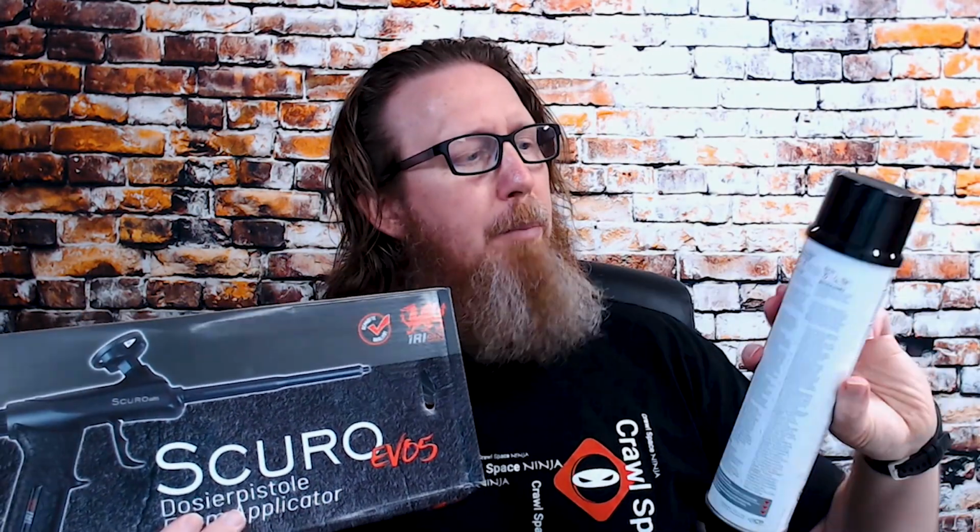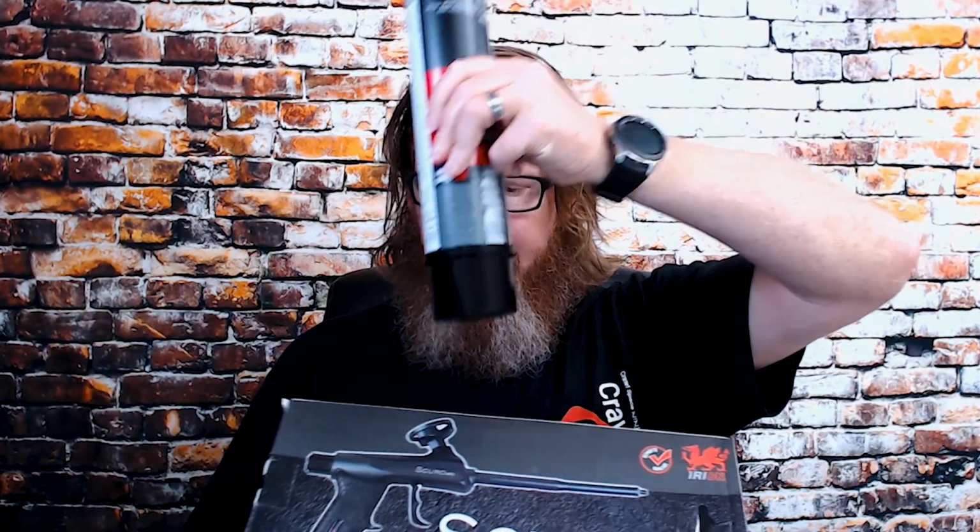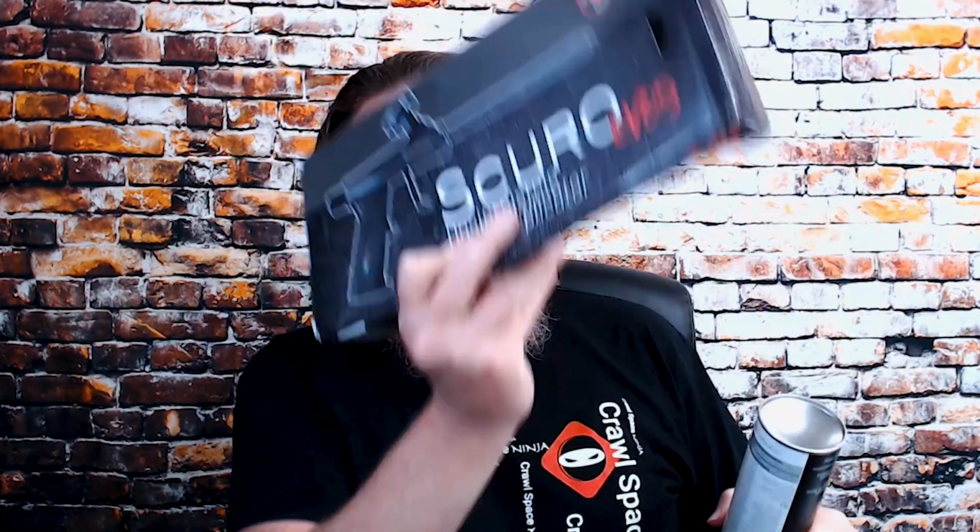Now, if you're in a part of the country like we are where you need at least an R10, you can actually use a spray foam gun like we have on our DIY store along with a one component spray foam. You would create a bead of spray foam about every 24 inches or so, and then apply the insulation vapor barrier over that bead. That gives it an air gap, and that air gap can bring the insulation vapor barrier up to an R12 or higher depending on how thick that bead of spray foam is. So it can still be used in a situation where you want to insulate your basement or crawl space if you don't have access to the EPS foam boards that are available.